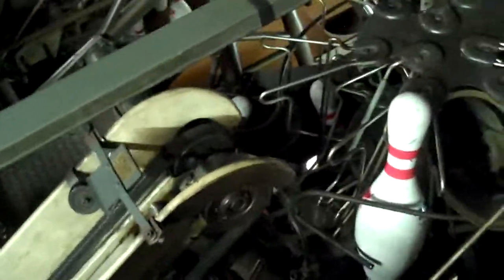As you can see, that block just keeps going back and forth. It's going to do that four times per cycle since it's part of the 4-to-1 assembly. And your rake cam here only turns once — that just controls the sweep pattern. I'll get a little light on that so you can see how that rake cam follower follows it.